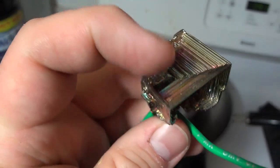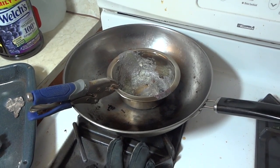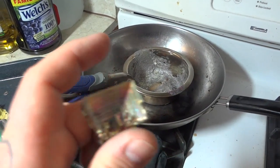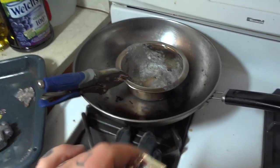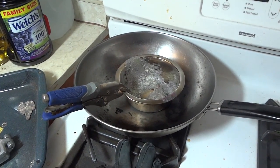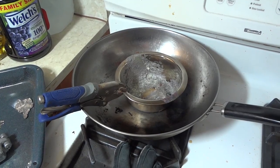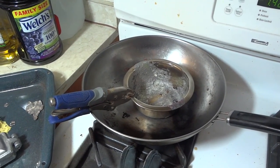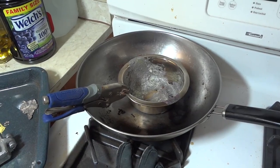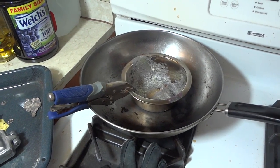Gorgeous bismuth crystals. I accidentally scraped it there. It's all about slow heat — slowly cooling — but you have to pour off the excess bismuth before it completely solidifies, and you have to have enough time for it to slowly cool enough to grow a crystal. Thanks for watching — this is molten metals on your stovetop. Do not do this, and do not sue me, because this is dangerous. If you don't use pure bismuth you'll have rancidly toxic chemicals in your lungs. If any drop of water comes into contact with molten bismuth it will cause it to splatter, and you'll have literally molten metal shooting into your face — insanely dangerous.